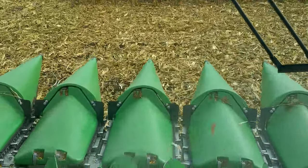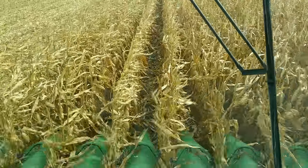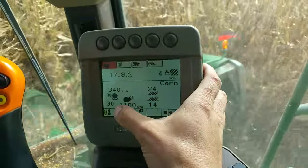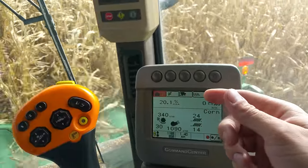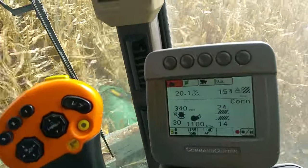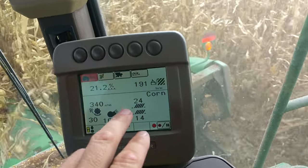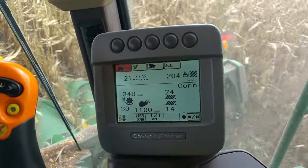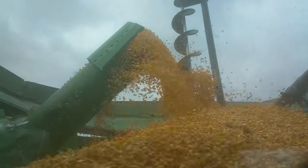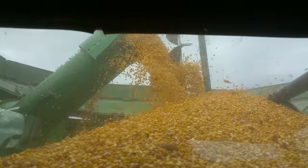Once it gets underneath and through behind us, it gets to the rotor. The rotor spins it around, and you can adjust your rotor speed and your threshing clearance here. The speed will adjust how fast that rotor is going, and the clearance will adjust how tight the concaves are around what it's threshing. Then this is your cleaning fan speed — it's got a big fan that blows some of the trash away. This will be your chaffer and your sieves, so that's what actually separates the kernels from the cobs. You can see it coming in here — this will hold probably 250, 270 bushels. I think it's somewhere in there.